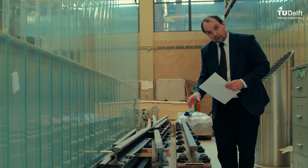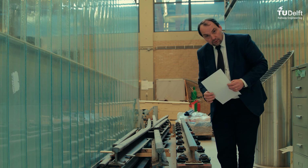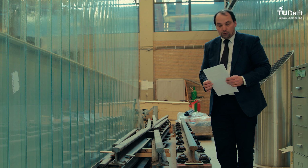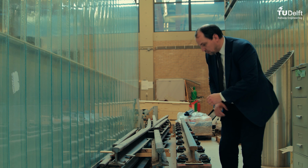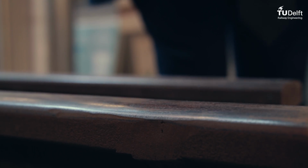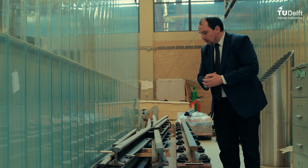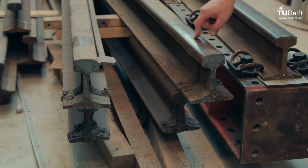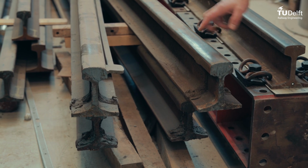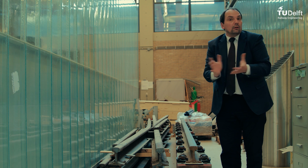And I think here we are standing at a certain turnout switch with the frog, and I have here a weld in front of me with some problems, like the squats. So I can point out what this looks like. When you have here, for example, this small indentation because of the wear, the softer rail will wear away, and in between is just the weld itself. It's harder, and just before and after the weld you get this cupping, and you get a good view of what happens to the steel, and that's how you get the squats.